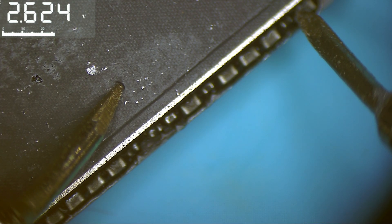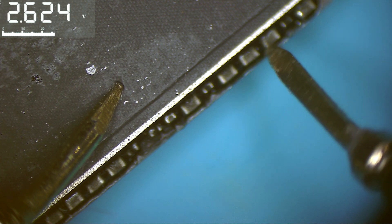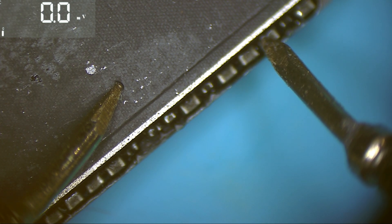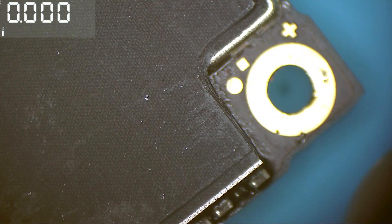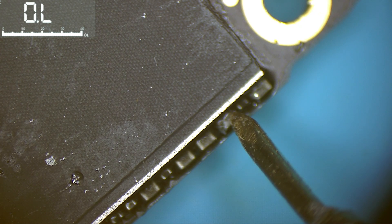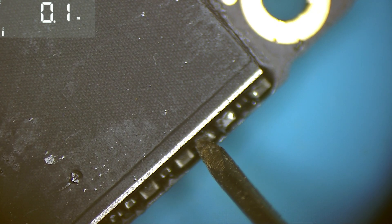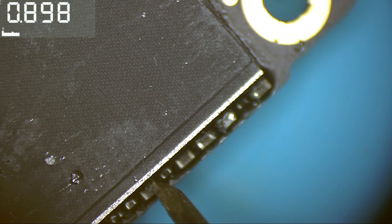Let's check the NAND power supply voltages. 2.6V is available and there. The 0.9V - I hate the connector of the battery for iPhone 8 and X, very bad connector, it's very loose. From here or from there - this is 2.6V also. 0.9V here, pp1v8 IO also.